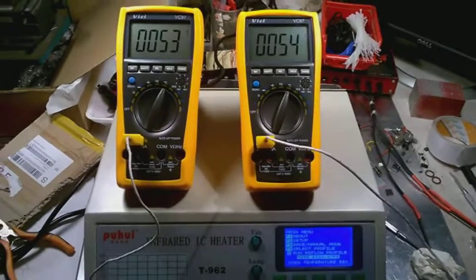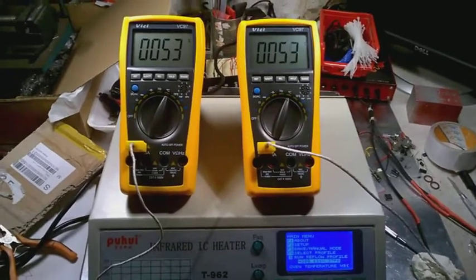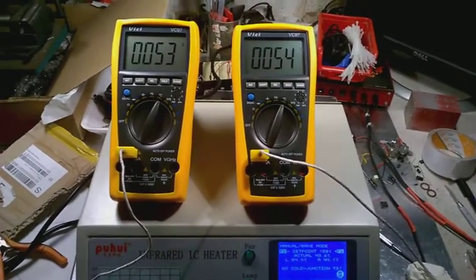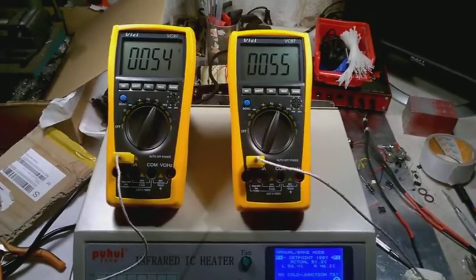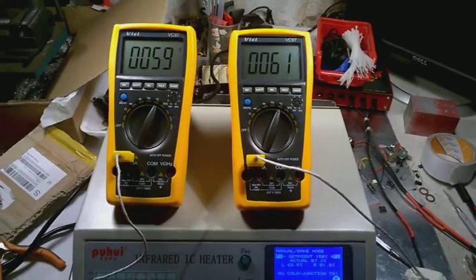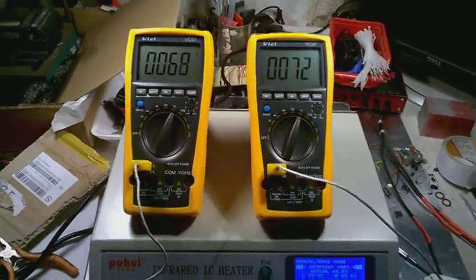Right now I'm playing with the oven in free run mode. I'm going to press F3, select bake manual mode, and I've set a target temperature of 150 degrees. You may see 'no cold junction temperature sensor present' displayed on screen.